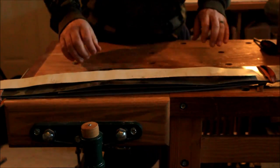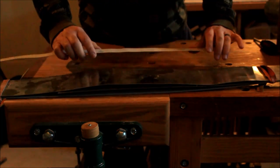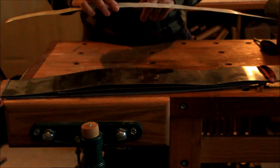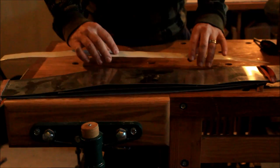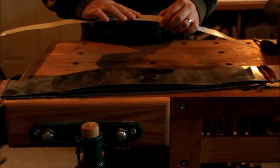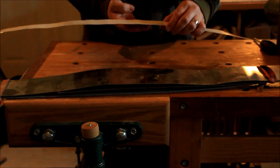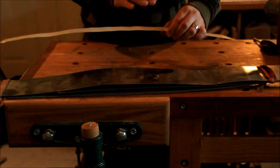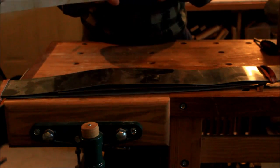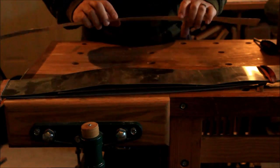Now, I also received questions about what kind of steel I'm using for bending the sides. So basically what that does is it prevents the splitting of the fibers on the top side. So if I'm bending something, this is going to be on the upper side. The piece of steel would be in between the heating tool and the strip. The thickness of them is 1/16, if that. I'm not exactly sure how thick they are.